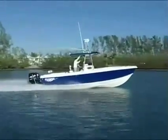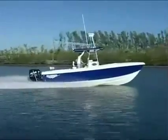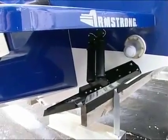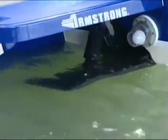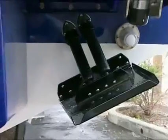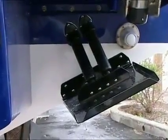What I would recommend is going with dual Bennett Trim Tab actuators, 2 for each side. Okay, so rather than the current scenario, where I have a single actuator, you're actually telling me to remove that, put 2, split them, and spread out that load. Absolutely. What you're going to have is a more robust system for that Bluewater.